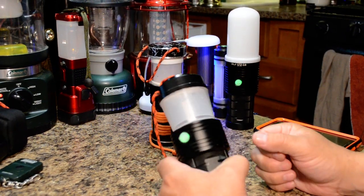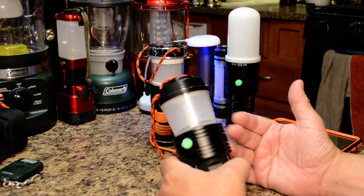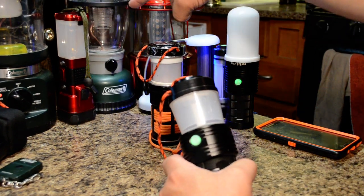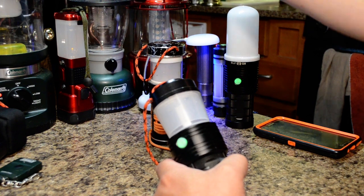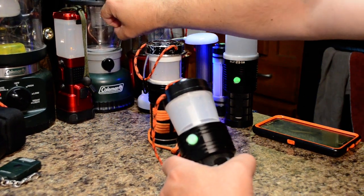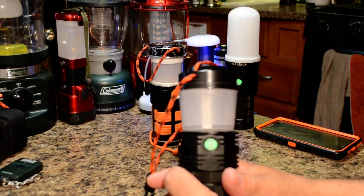A mild frosting on the lens is much better, and I'd recommend going with a lexan or polycarbonate type lens — similar to what safety glasses and snowmobile helmet visors are made of — because it can take an impact and doesn't crack. It might dent or scratch, but it won't shatter. A lot of factory lanterns use acrylic lenses, which crack like glass. I knocked one over and it cracked, whereas a polycarbonate lens doesn't break.